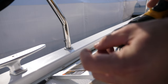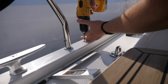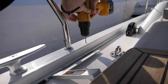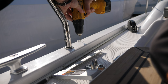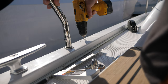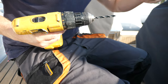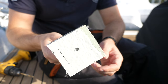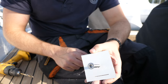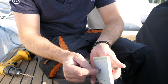These drill bits with the very fine point on the end are super convenient because they really give you a nice, accurate hole. Looking good so far. Even with a 7mm it binds there, so I think it's just going to have to be an 8mm hole, and then a 6.5mm where it goes to the aluminium on the other side, and then I can tap the aluminium.